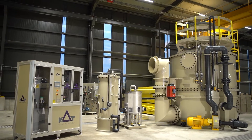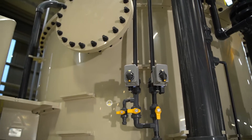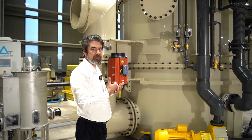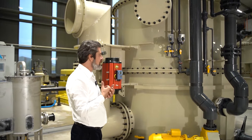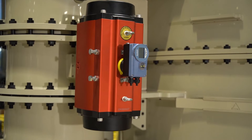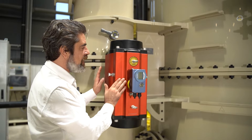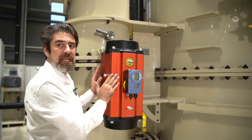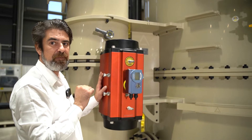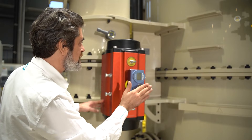We are mixing this ozone into our protein skimmer. Some details about protein skimmers: adjustable washing motorized valves allow you to set intervals, like every 10 seconds, once per hour, or once per day — it's completely adjustable. Most importantly, a pneumatic or electrical valve regulates the level inside the protein skimmer. This is essentially the heart of the system because it provides precise level adjustment autonomously, millimeter by millimeter, without any human touch.